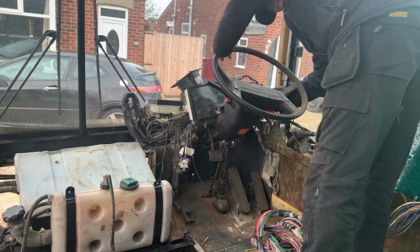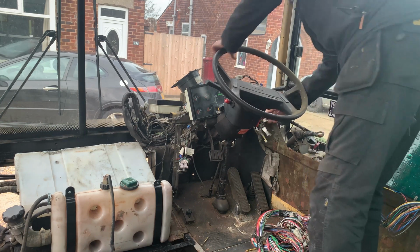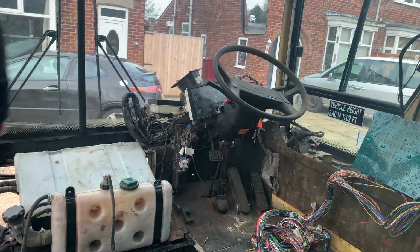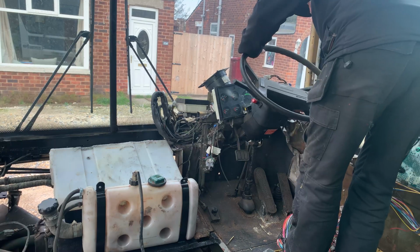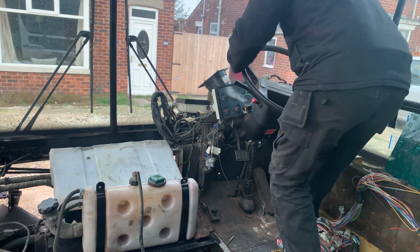Really? No, flat batteries. Okay. Right, we did find out that the trickle charger that I've had on the battery all the time, it is an automatic 12 volt, 24 volt. Apparently it decided that the batteries were 12 volts and charged it up to 12. So we had about 13 volts in them. So quick charge, quick boost, got it all sorted, and this is the startup.